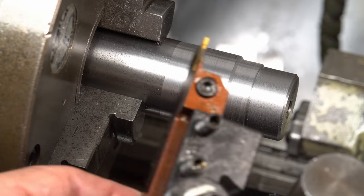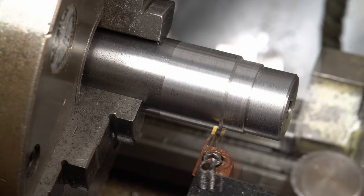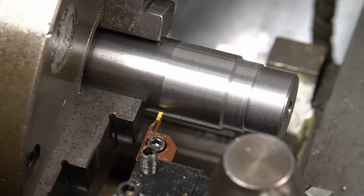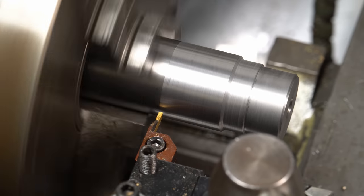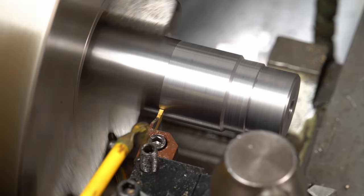This parting tool takes a 2mm MGMN double-ended insert. I don't have any right biased inserts. I usually re-grind the inserts after they start to dull using a diamond wheel. But I've shattered a few recently, so I'm having to use a new one. So the cut's parallel to the workpiece and it'll leave a pip on the part rather than on the stock in the chuck.